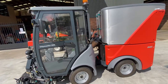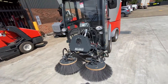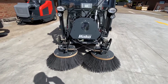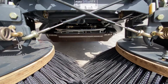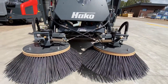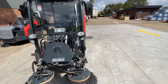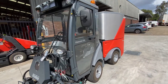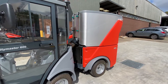The unit has a lot of features both on the operational and functional side. It has two outrigger brooms which bring debris into the center so it can be picked up with the suction head underneath. The suction head is removed without any tools, so if you want to change over to a mowing head, for example, you can do so quite easily. Let's have a look at the engine — it's a three-cylinder Yanmar engine.